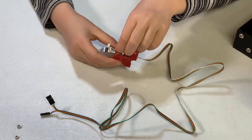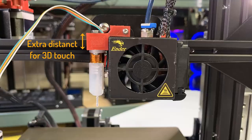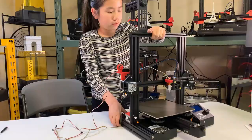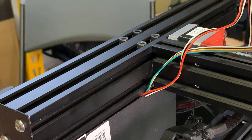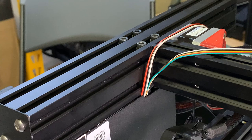Next, we will mount the 3D Touch. The 3D printed mount has added an extra 3mm, so you don't need to add nuts to extend the sensor. We can remove the Z-limit switch and the cable, since we have the bed leveling sensor and won't use them anymore. We can run the cables of the sensors through the same gap. The 3D Touch cable is a little bit short, so we will use this gap to reach the motherboard in a shorter distance.